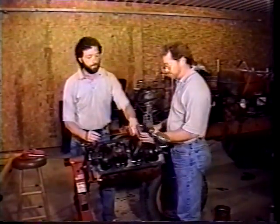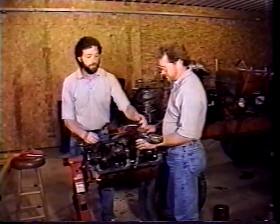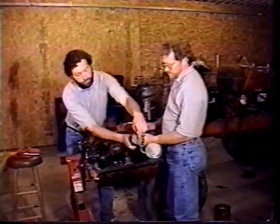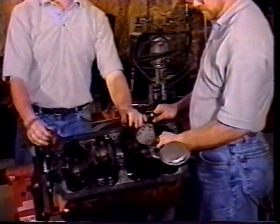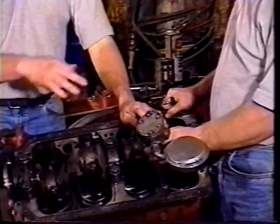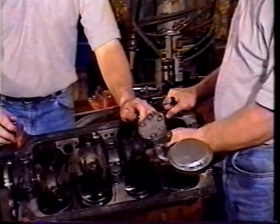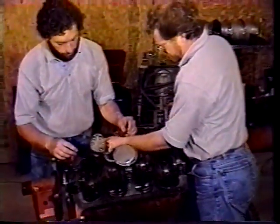We didn't take this one apart. The tractor had great oil pressure prior to taking it apart. If you have to take it apart, it's got a screw face on here and there's a gear in there. Now, you can't buy a kit. I checked when I was at the dealer. You have to buy each part separately. So it's not a real common thing to rebuild these pumps. Not like a Ford tractor where every time you rebuild the motor, you have to rebuild the pump.